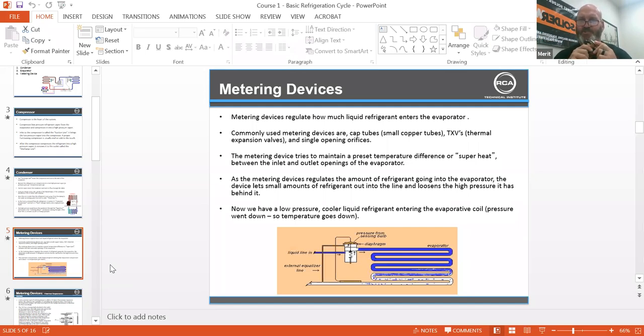Jim is one of the best refrigeration techs I've ever met. Any comment on the TXV vs EXV? This one actually went bad. It's a rebuildable EXV — much like what you'd see in an OVE expansion valve where you can rebuild the guts. You can see the hollow valve body. This piece comes out and it's rebuildable. It throttles and steps — it's like a stepper valve on a refrigeration case. This is what an EXV is; it's just a really big one.